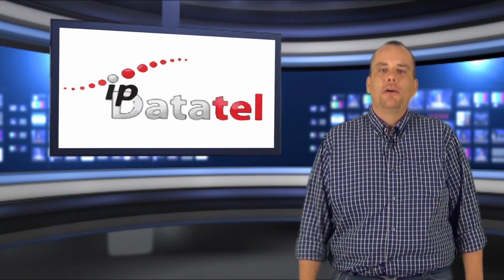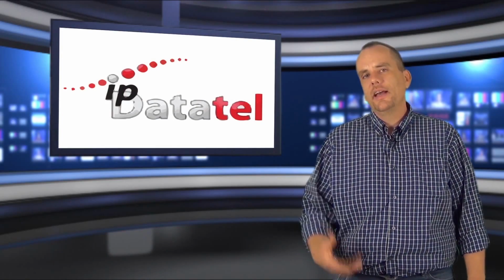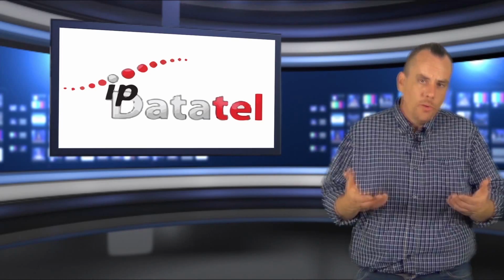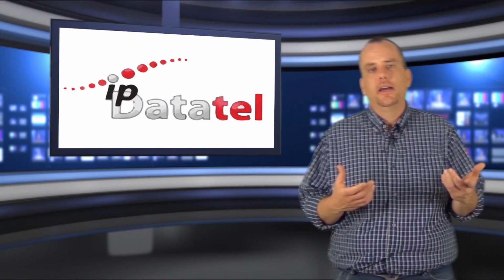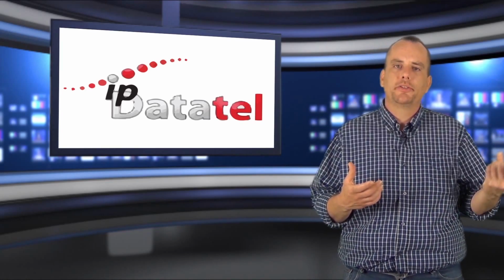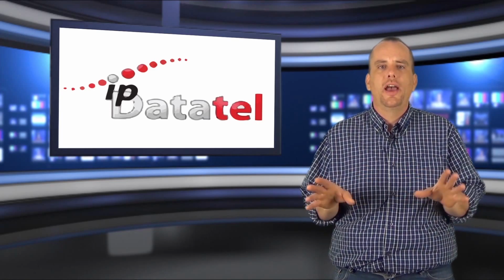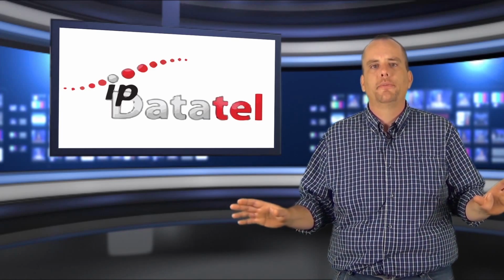All right, that was the smartphone app. Now, the last thing I wanted to talk to you about was the installation. On the hardwired panels, you'll put the piece in your panel, you'll wire it to your key bus terminals, and on the Honeywell Vista and the GE Networks panels, that's all you have to do. That's where they get all their information from.